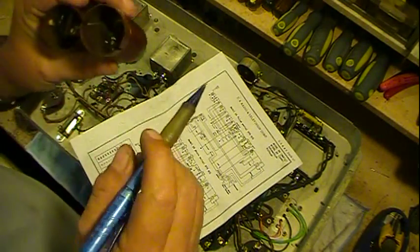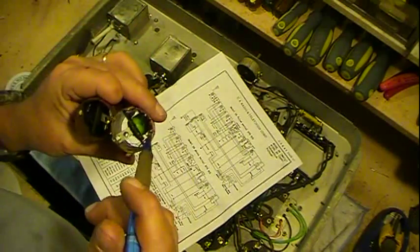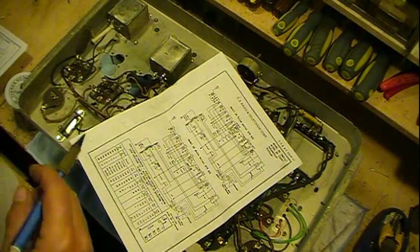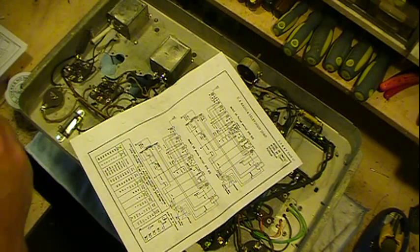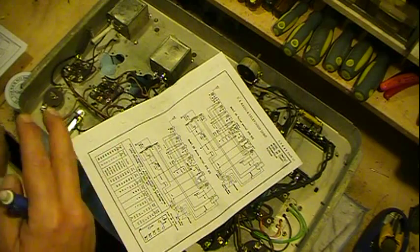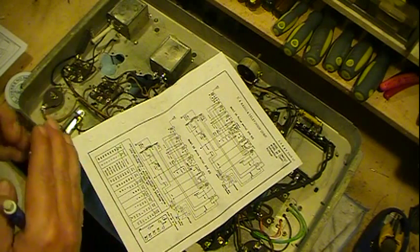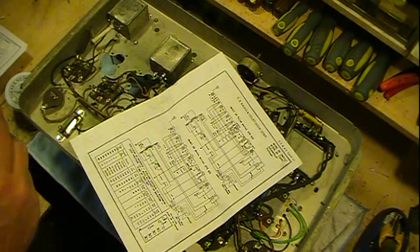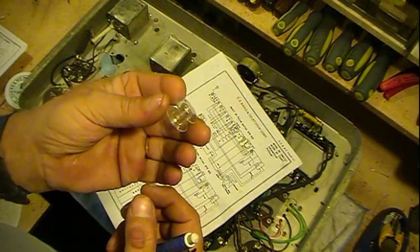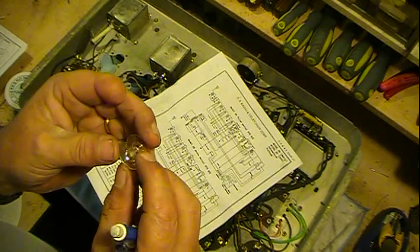Now, as you can see down inside here, I've got my new coils that I rewound inside here. One's there, and one's inside here. And all I did was, basically, I would have used the old form, but it was just a piece of wood with no sides or anything. I was going to have to develop some sides, and then I was going to have to do a little gluing or something, or lacquering or something, because it's going to be several layers of coil. So I decided that I'd go a different route and use something like this. And all this is a sewing machine bobbin. The ones I actually used in there is just slightly smaller than this. This one's a little wider this direction.